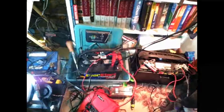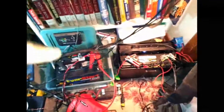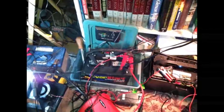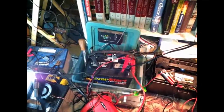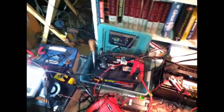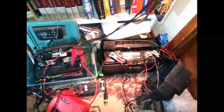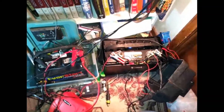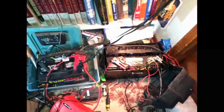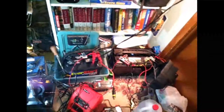Not that they're bad or anything. I've had a good experience with my Group 24, which is a little bit smaller battery with less capacity — it's 105 amp hours. That was a 125 amp hour battery that failed. So far the 105 amp hour battery has been working well, actually with slightly better performance. But this one wasn't giving me any signs that it was failing — no weird smells until a couple of days ago. It just finally shorted out and failed.